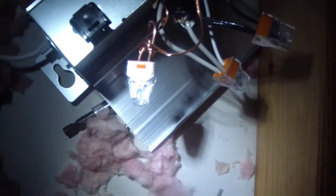Here's how this thing is wired. Here is my original electrical box. I took one Romex piece and added it to the halo box here — they have push connectors, so all the whites push together. I have one Romex coming in connecting white to white, black to black, ground to ground, and then one Romex going back out serving the other light fixture. For the second fixture, the black goes to black, white to white, and green to green, using wire nuts.